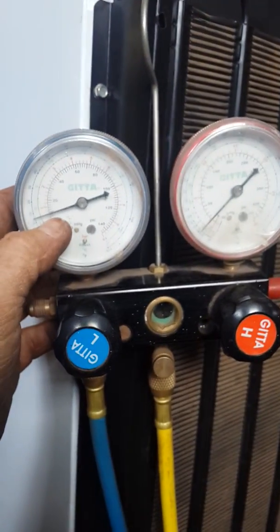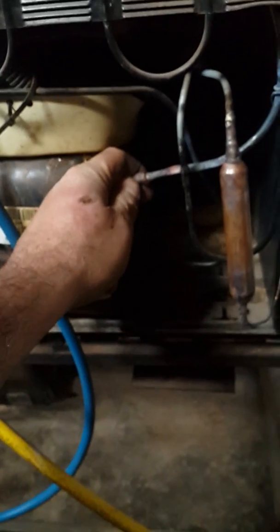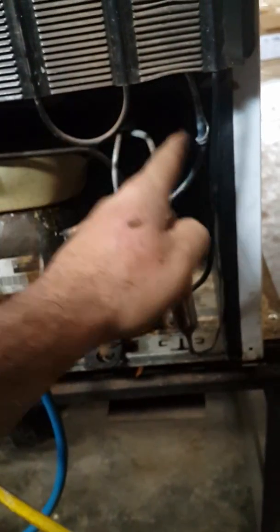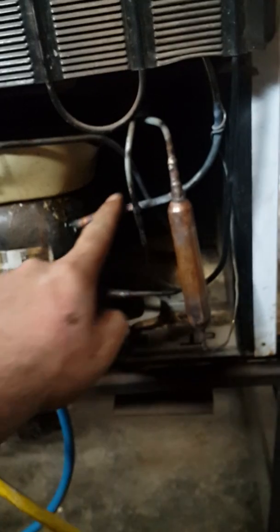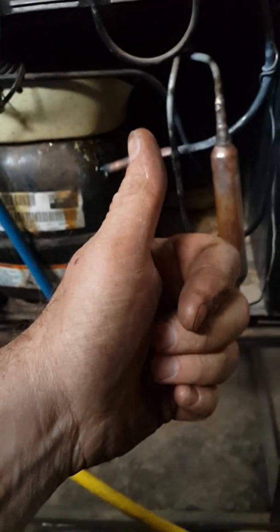That's how you do it. You don't want to charge it up too much — the moment you overcharge, you'll start seeing ice forming around the suction line. Once you see ice build-up, you know you have too much gas and you need to start releasing some until the frost line pulls back up into the fridge. You only want a little bit of dampness on the pipe and then it's fine. Like and subscribe — see you guys next time.